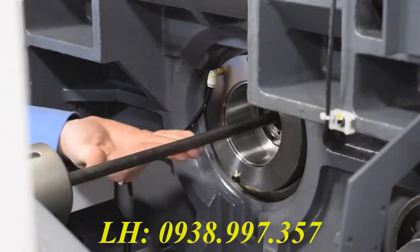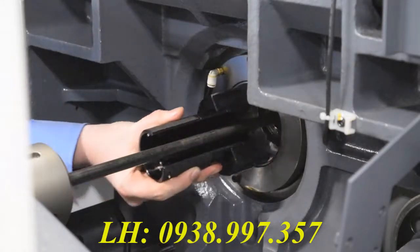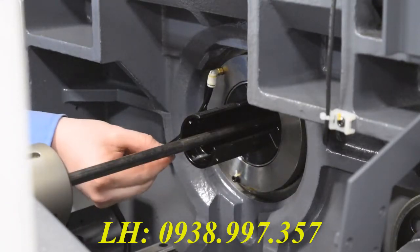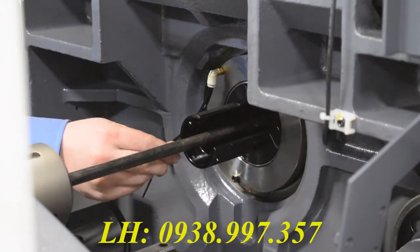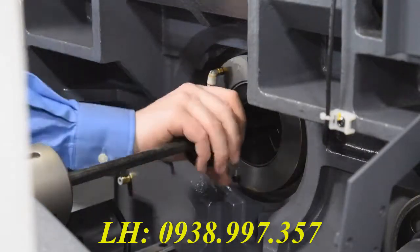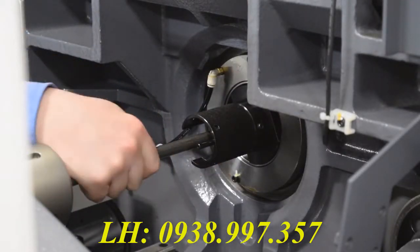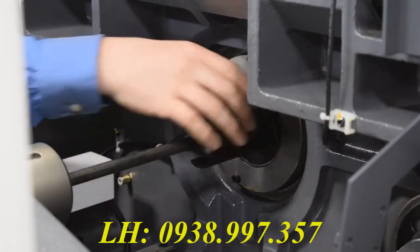At this point, your bar should be loose. You want a snug fit in the guide bushing, so insert the tool to tighten it. Break loose the set screw from earlier. Now you can change your guide bushing setting. Simply tighten it down and check as you tighten it to see where your bar is. Once you get a snug fit that you feel comfortable with, you can then tighten the set screw and lock your setting in place.